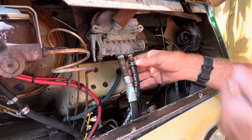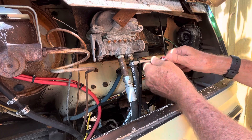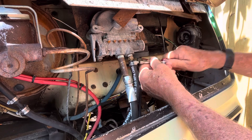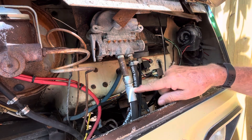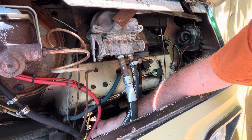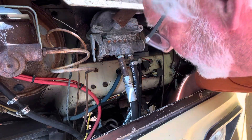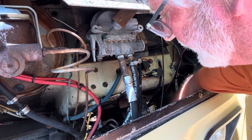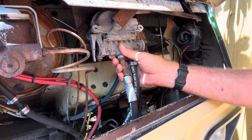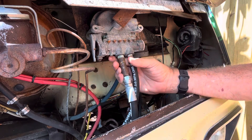Here's the cable. Now this hose on the right-hand side is a return hose and it's literally put on with a quarter-inch hose clamp — nothing special. There's a barb coming out of here. This hose goes down to the power steering pump. Well, actually it goes to the power steering box. The pump first goes out of the pump to the box, then from the box up here to this motor. Then it'll either bypass if the pin is not pushed, or route through here if it is pushed.